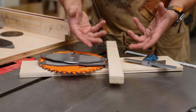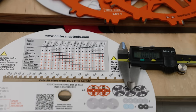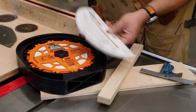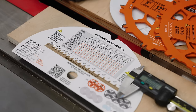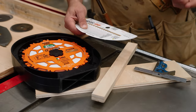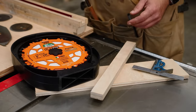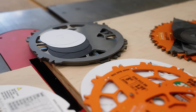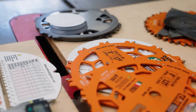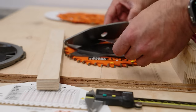With a pair of calipers, measure your material — this is 0.715. Then look at your chart: I'll go with 23/32nds, which is 0.718. Sorry, imperial people, but metric is better. That says 23/32nds is going to be the left and right outside blade, three chippers, one lock spacer, and a couple of shims.